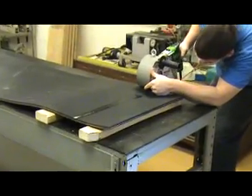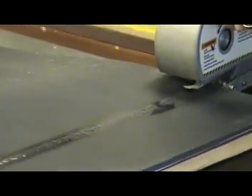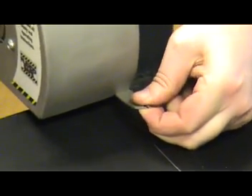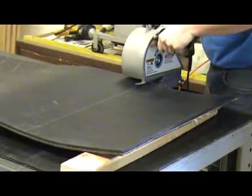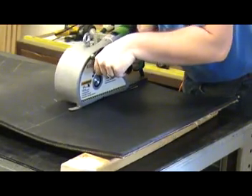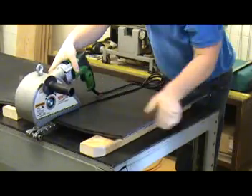To begin using the tool, lift the blade guard and insert the belt between the carriage and the blade guard. Now position the electric belt cutter so that the slot in the cutting guide is directly centered above the line on the belt. After the electric belt cutter has been positioned on the edge of the belt at the square line, and the cutting guide on the belt guard is aligned with the square line, squeeze the trigger and begin your cut.